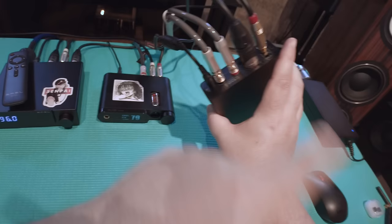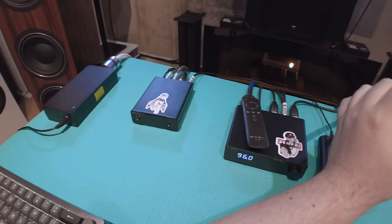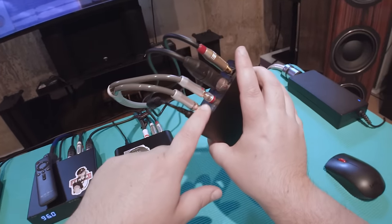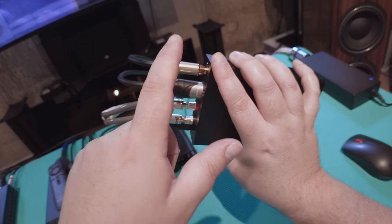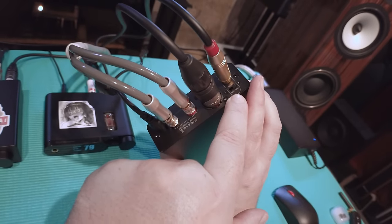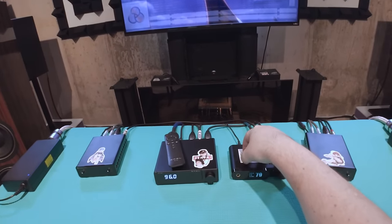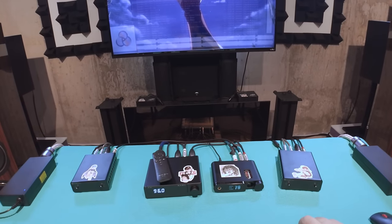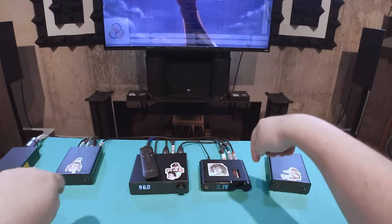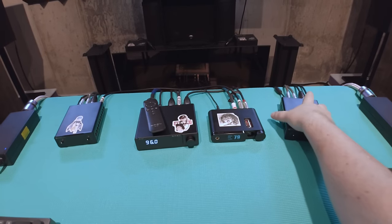...and it got so much cleaner and more direct — holy shit. On the back: power in from whatever power brick. I've got these nice RI cables from Italy which cost more than probably everything on this desk, going out of the little five-way binding posts. We've got World's Best RCA and XLRs, and the RCA right here has a switch for either 31 or 25 dB — so you've got gain control. If you're using a turntable you can put it to 31 to get a little more out of it, or bring it up to XLR level so you're not having a big swing in volume.